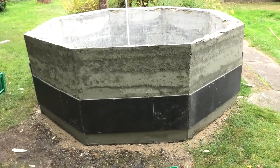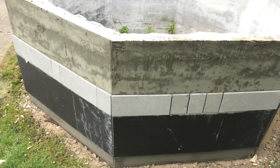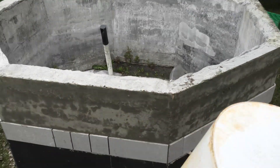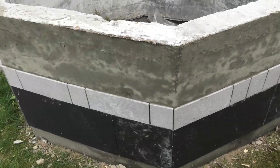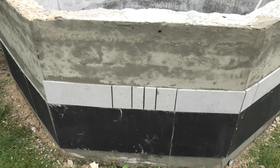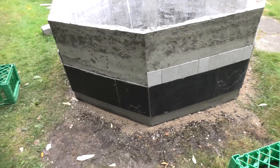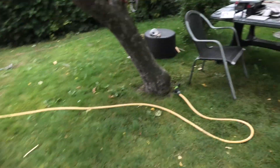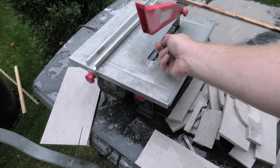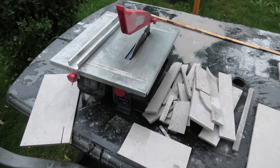I am missing three pieces — three walls now. So we started here and I'm moving around this way. There isn't much space between the tiles here; that's probably okay. And here is another one and another one. Then I came up with something else here just to use some more leftovers. I am absolutely out of diamonds on this blade — it cuts on one side but the other side doesn't cut at all. This one just doesn't want to go anymore. I need to replace that blade before I can cut the rest.